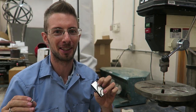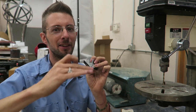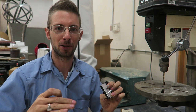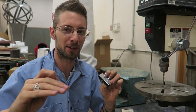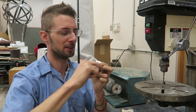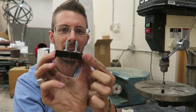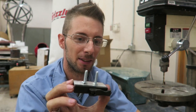And this is where the magic starts to happen, because the washers and nuts you add between here and the L bracket are how high it's going to position your camera looking through your scope. So now you're adjusting the height of your camera to line it up perfectly looking through your scope. So I'm just going to go ahead and throw some nuts on here so I don't have to keep wrestling with these bolts in the back to come out. Okay, so this is what you should have right now. Maybe you don't have the nuts there, maybe you do.